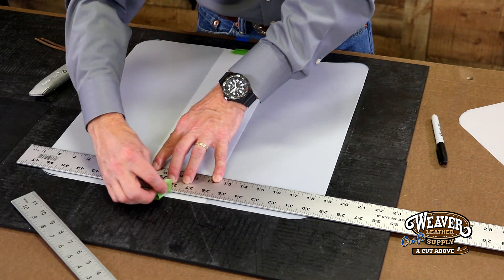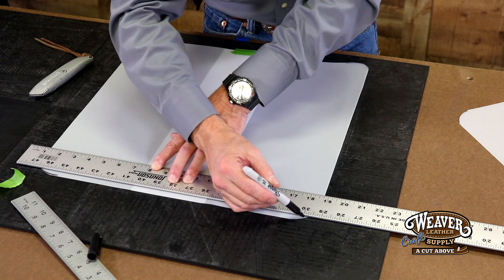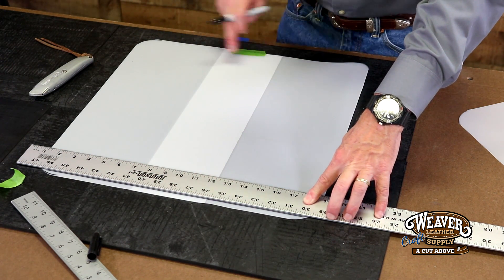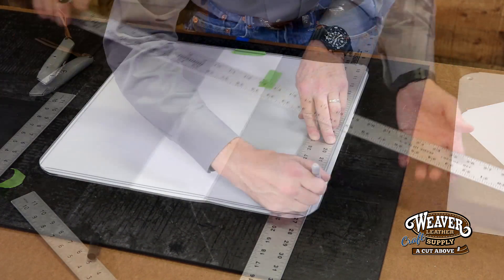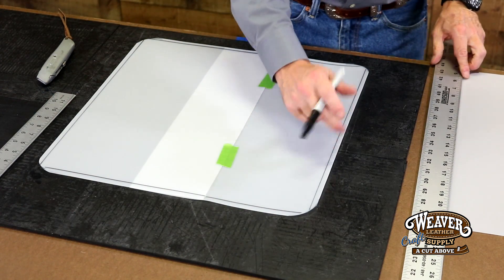Let's bring our tape out and with a Sharpie we're just going to drop in a line. We're going to deal with our round corners here very shortly. What I'm going to do is draw in three additional lines, three-eighths of an inch in from the edge, then we'll mark for our holes. And my last line — very nice. Now for our round corners, we can certainly freehand those, but let's use our pattern.